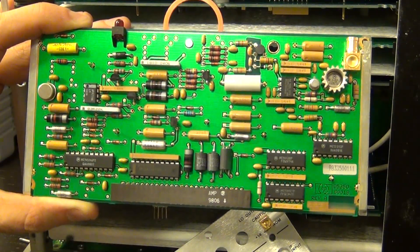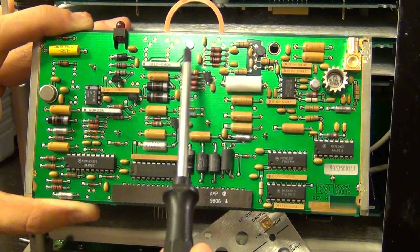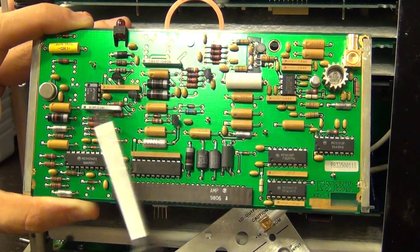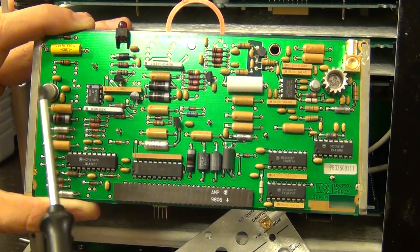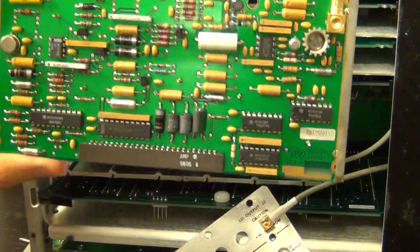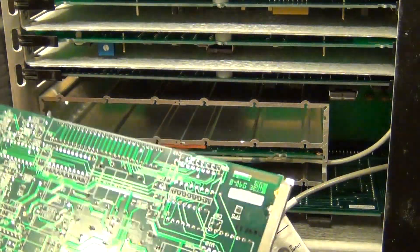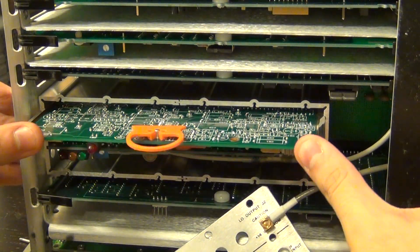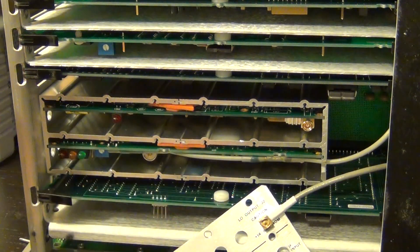I'm going to show you the schematic from the service manual. The quality of the schematic is really bad from the service manual, but as I said before, I was right about the Colpitts VCO configuration. Here's the VCO, here's that little diode I pointed out — here's our PN junction varactor — and here are the three inductors I told you about. By changing the voltage here, this voltage will change the voltage across the PN junction varactor, changing its capacitance, which in combination with the inductors in the Colpitts VCO will create the free-running center frequency of the oscillation. This is the main transistor responsible for the VCO. If this transistor is dead, the synthesizer wouldn't work. If the diode is bad — if it's a short — the VCO will not work.